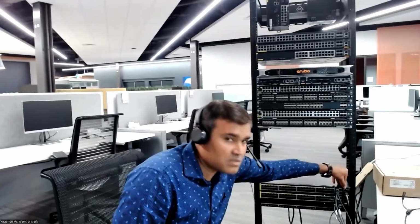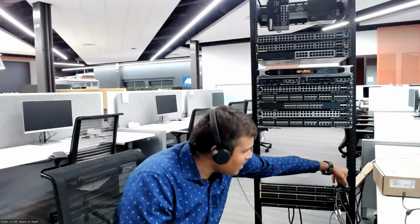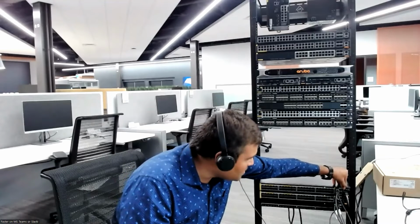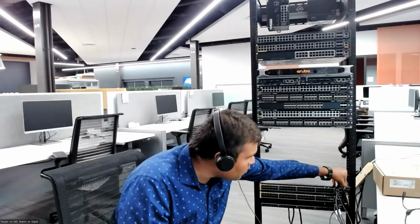So for operational efficiency, this is what we have done, and network engineers and IT admins will definitely appreciate this one. Take a look at this one. I'm going to press this LED mode button 3 times. Now it's at the PoE. Next is going to be the speed. Don't keep it there. Move it one more. Keep it at the stack.